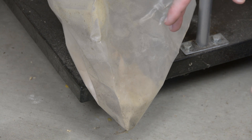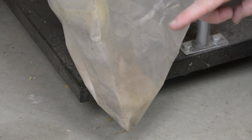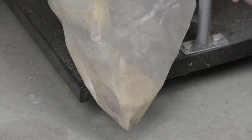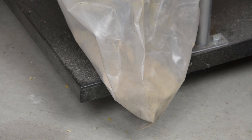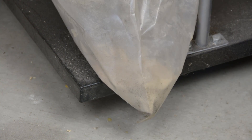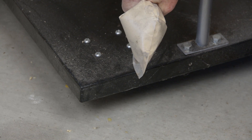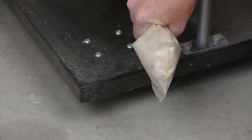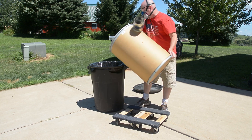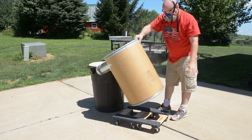Now while all of that dust sitting in the fiber barrel might look great, it's only really impressive when you understand the total percentage of dust that ended up in the barrel. This is the second time I have emptied this barrel since its original construction — I don't even remember when. This is what's in the bag. I have beaten the filter with a stick and gone around and tapped the bag and tried to get as much settled to the bottom as possible, and here it is — not enough to pipe icing onto a couple of cupcakes. And this is two barrels full of stuff that went out the other way. Whatever you do, don't go breathing all the dust you just collected when you empty the barrel — take it outside and wear your respirator. Remember, there's glue and whatever you vacuumed off the floor mixed in with that wood dust.